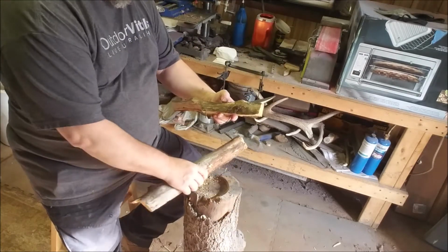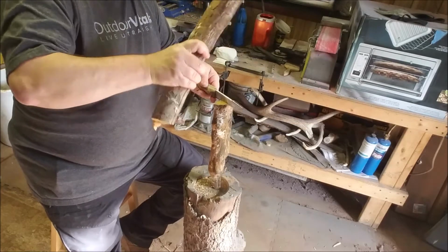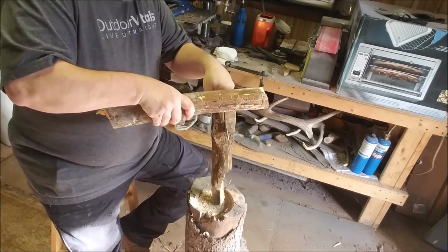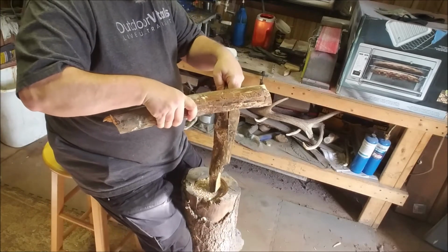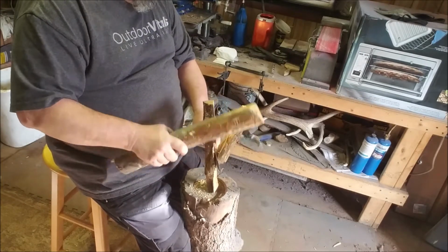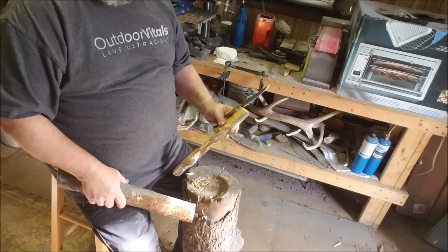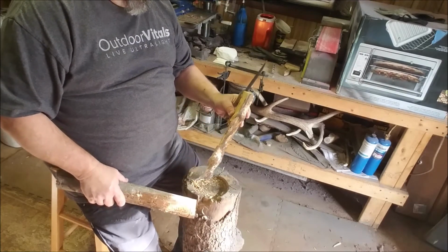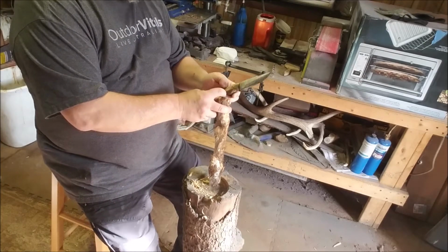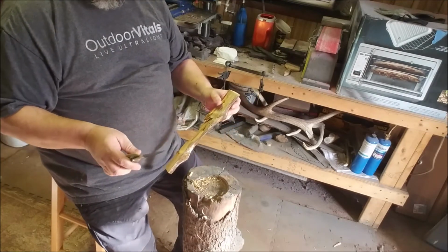This is kind of sickening in a way, but I had a real good temper on this blade, right where I wanted it, about a medium straw. And then dadgummit, I went ahead and put it in the temper cycle again for an hour and a half, and when it came out of that temper cycle at 400 degrees, where I tempered the last one, it was deep. It was real dark straw, and even a little blues in there, some browns, blues. So it got a little hotter than I wanted. If I was selling this knife, which I'm not, I wouldn't even sell it because of that. The temper's a little bit off on it.